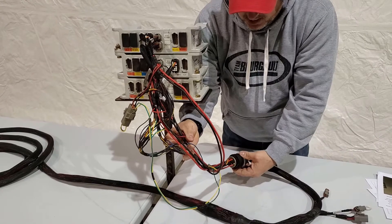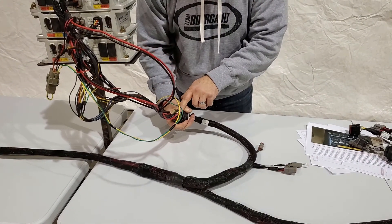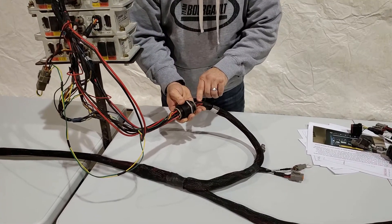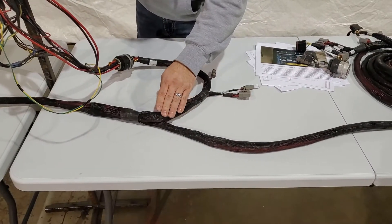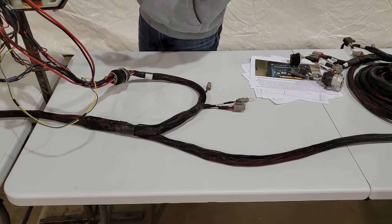When you get to the action breakout, we're down to one single blue wire that's in pin 2. That flows through the connector on pin 2, and the blue wire runs all the way back from our central ECU stack to the ECU stack on the back, or the rear implement harness.